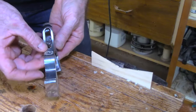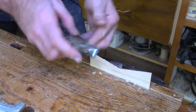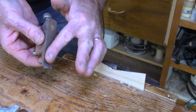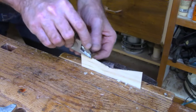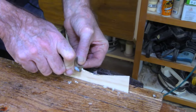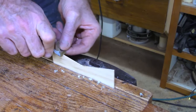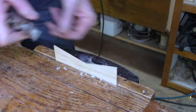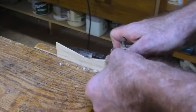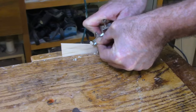So I took the front end of the shoulder plane apart, and I basically made a bullnose type plane. It's almost like you're holding a chisel in perfect plane with this piece, so that now the cutting edge is right out front. So I can use that flat that I just established and just finish it. The shoulder plane is now riding on the flat, and I've got a nice chew. I could have tried doing this with a file, but I've got a nice flat surface there now, very quickly. Nice way to clean up a little band sawing.